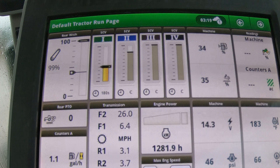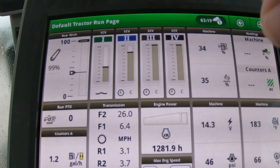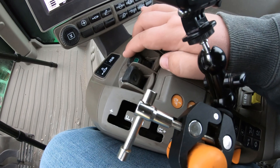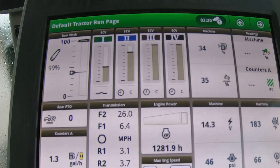The other mode is float. Float allows hydraulic flow to go back and forth freely — useful for implements like mowers or plows that need a little give. When you drop an SCV into float, a squiggly line appears underneath it on screen, and there's no flow shown going in or out. The valve is simply open, ready for whatever happens: if the cylinder moves and flow needs to return to the tractor it can, or if it needs to extend again it will. Float is ideal for rough terrain with implements that require it. To engage it, push forward on the switch until it stops, then push one more time — it clicks down into float.